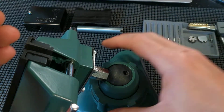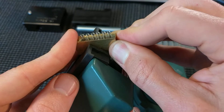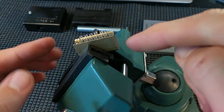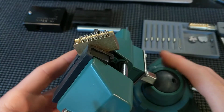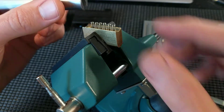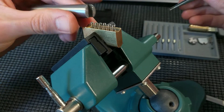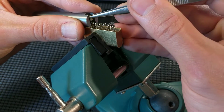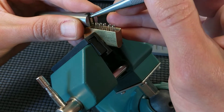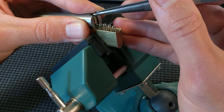I'm going to put it in the vise and clamp it tight enough, but not too tight because you have to hold the plug in place while you undo the vise. I'm going to turn this so you can see a little bit better. You can see the follower just holds that in place, and then you can kind of steer it a little bit by rotating the follower back and forth and pushing it with the sides of the notch.